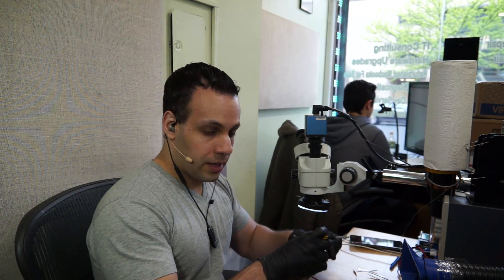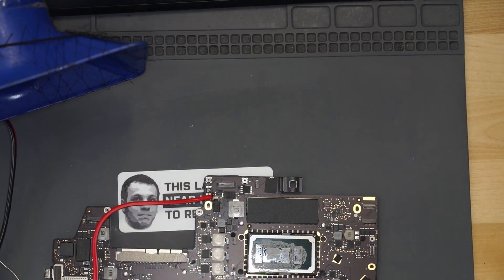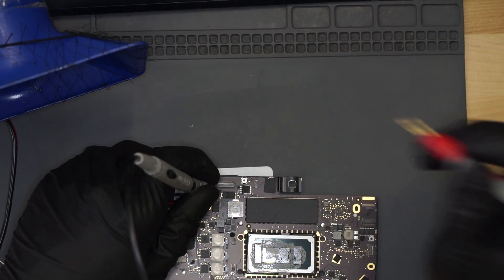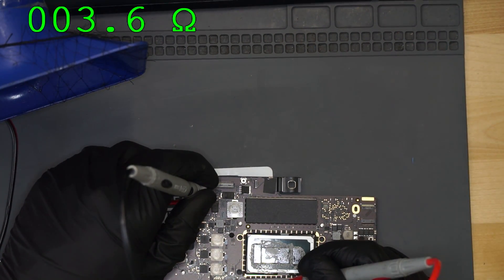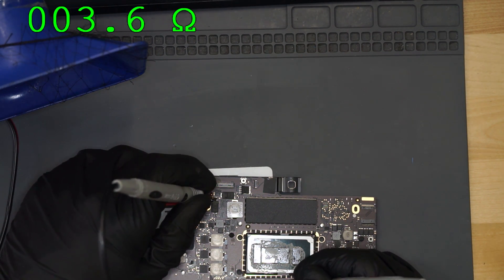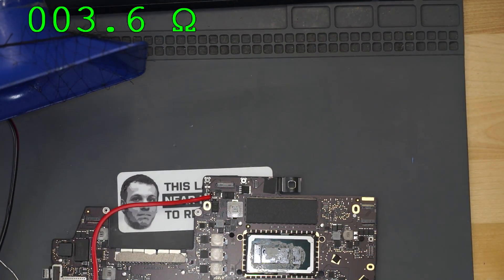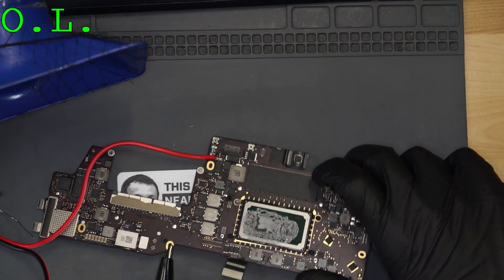Actually, here's a good trick. I only injected 0.8 volts into that, which means even if the CPU MOSFET was shorted it would be fine. So I'm going to check my resistance between PPBus G3 Hot and my CPU coils. So remember, PPBus is shorted to ground. CPU V-Core is always going to be a very low resistance to ground, but at 3.6 ohms I don't think it's something too terrible. So we're not directly shorted. If that was 0 ohms, I would say the CPU MOSFETs are what is shorted to PPBus and that's what's causing our issue — but it's not.